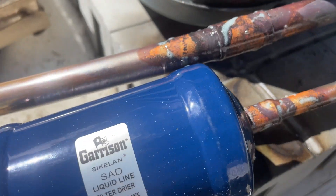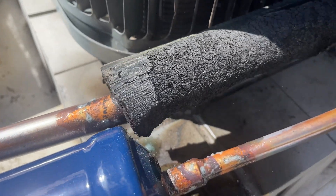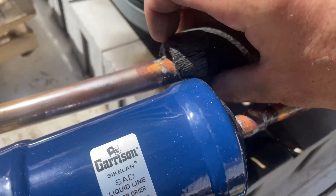I'm going to put some of this old ArmaFlex on this — I really wish we had some new stuff. I don't want this leak to happen again. I know the textbook way to do this would be to break the vacuum with nitrogen just to recalibrate that micron gauge and triple evacuate the system — I'm very aware of that. The problem is I'm out of nitrogen. One thing about building maintenance is we don't get parts like the HVAC pros do. Trust me, I've worked on both sides, so I'm going to have to just call this good and break vacuum.